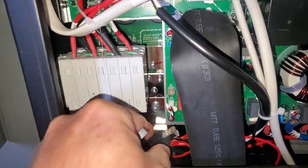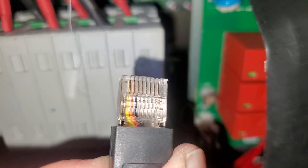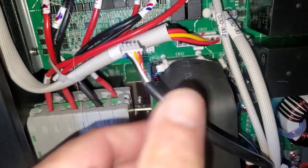This is the little cable here. This is the RS-485 port for the Solar Assistant, so you can see clearly there — it's got the yellow, orange, and black wires. That's how you know it's RS-485. You pull this little wire out over here.